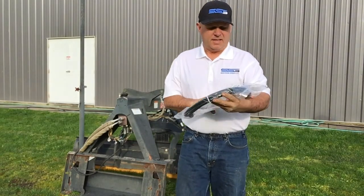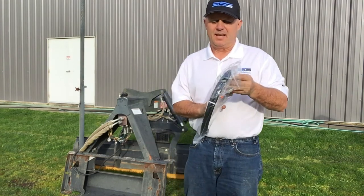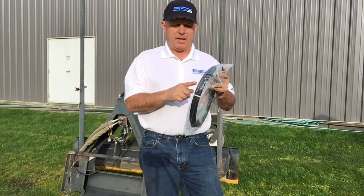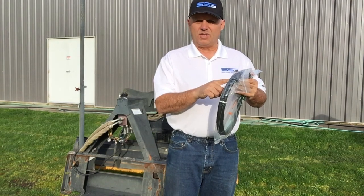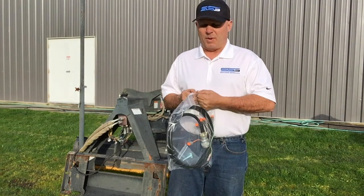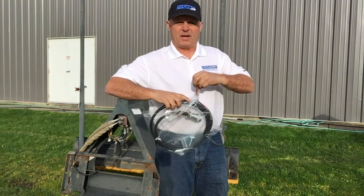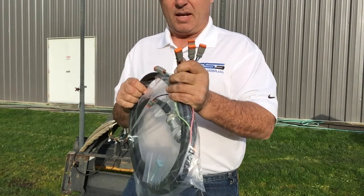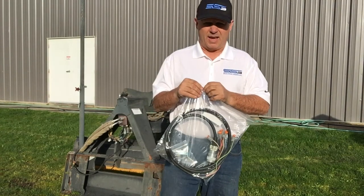This is an example of one of our kits — the SG BPH 14-6-9DT. What this stands for: SG is Skidsteer Genius; BPH is bypass harness; 14-pin with a 6-output harness; 9 feet long; and DT stands for Deutsch. If you look on our website you'll see different connectors that all the manufacturers have used throughout the years. This is a 2-pin Deutsch connector that you're looking at here.